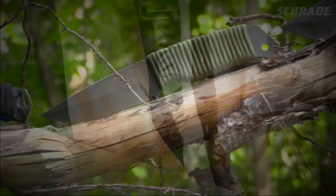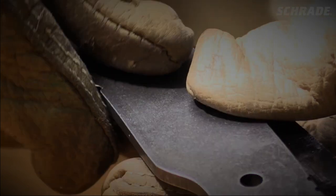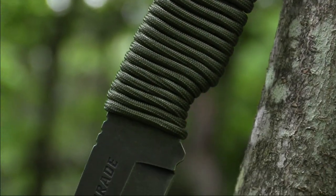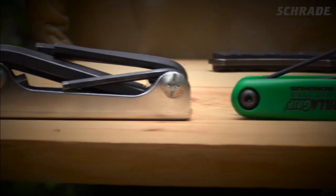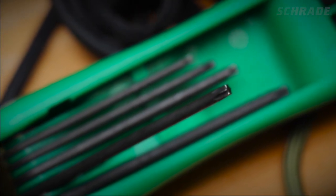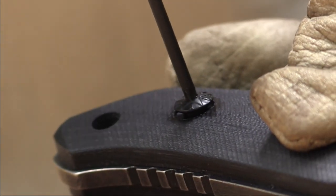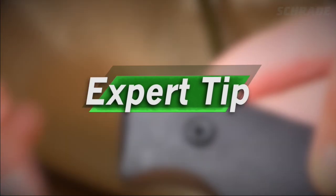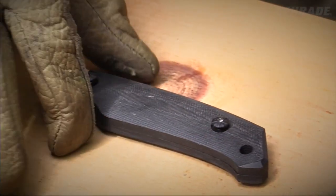This wrap works either way, so the choice is yours. In this training, we're going to remove the handles from our Schrade SCHF-13 fixed blade full tang knife. To remove handle slabs on most knives, you'll either need a star or a hex wrench set. For the SCHF-13, we're using a T9 star wrench. Now remove the two handle bolts. To keep from losing your handle fasteners, run the bolts back through the handle slabs and screw them together.